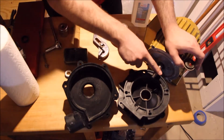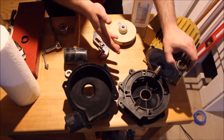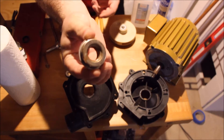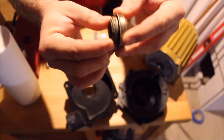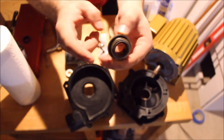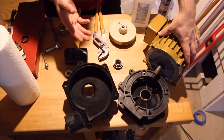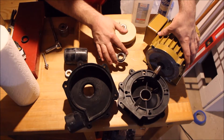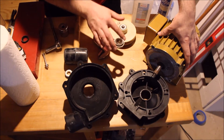External pumps — because the motor shaft is air cooled — require a separator between the water and the actual pump motor itself. That's what these seals do. This is the old seal I took out; it's really corroded. It has a little ceramic ring on top and an actual spring so it can move in and out to hold the seal in place. As you can see there's a lot of rust and corrosion built up on it. Inevitably over time these seals just fail. When I took the old tank down it wasn't leaking, but it had already been in use for a year and after sitting for another three years, I figured there's no point taking a chance on this old seal — it might just fail and you'll have a leak and spill situation. So it's best to avoid that if possible.